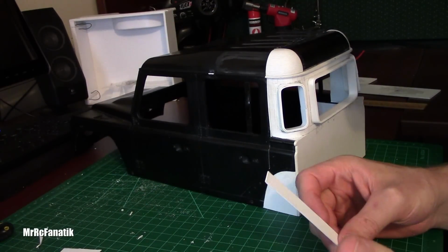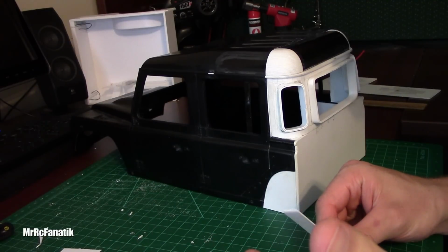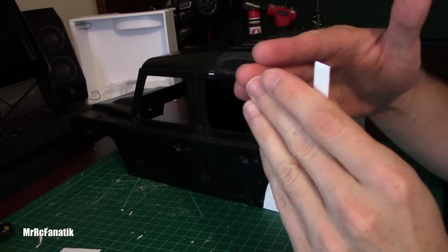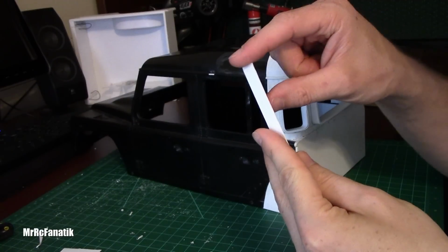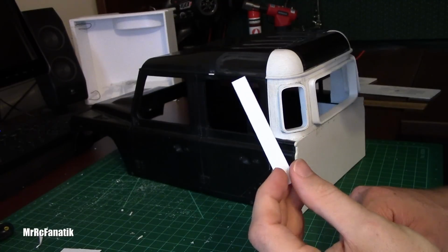For that, you can use some kind of jig. You can get some rulers or find some boxes or some kind of hard metal object that has a 90 degree on it. You can place it along the one side, maybe even tape it on there, then heat the bend section up and then bend the other area down, and that'll give you a nice 90.